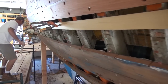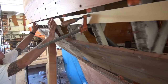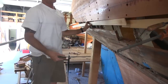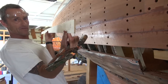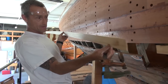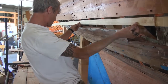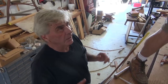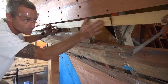How many marks will you make along the way? We've been doing each frame. You can see this piece of wood right here — it's got a real curve back to it. Has it got a frown or a smile in it? It's got a frown. That's what we want, because the plank will have a frown in it. Sometimes if you cut a piece of wood, it'll relax into a slight curve, and that's fine — it can help you. We need all the help we can get.